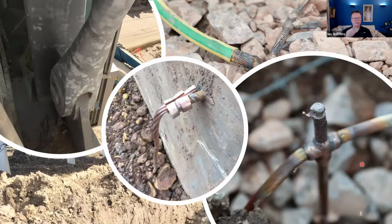Ooh, and the water table. Yeah, testing with the water table is an interesting one. Again, it's about being mindful of what's going on around you. With coastal installations, particularly tidal ones, you're going to see the tide go up and down every 6 hours or so, and the water table will likewise go up and down. If you did hourly earth tests over, say, a month, you would see the cycle go up and down, up and down. So be mindful, especially if you're in areas where there are tides, that the seawater will have a massive impact on your earth readings. So it can be useful to actually take tests over time.